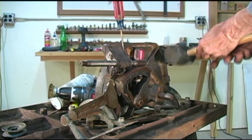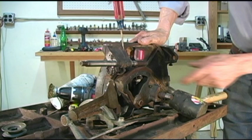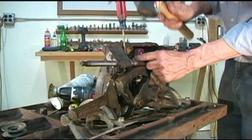I want to see. I didn't go that far. See if I can see what stopped it. You have to have this housing out far enough that you're not making contact with the threads on this. Otherwise, you can't move this shaft back and forth. So what I'm going to do here is see if I can open that up a couple thousandths more.